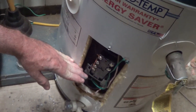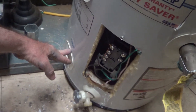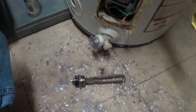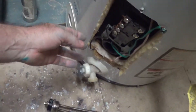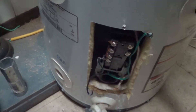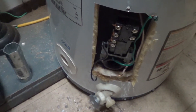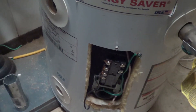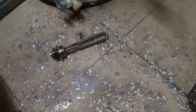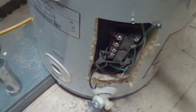I could tell this thing was only about two-thirds drained, so I figured maybe there's a tube going up inside — but the real story is when I undid the element all this crap came out. If you do this, make sure you've got all the power off — you've got a dangerous situation with a lot of water, so you need a proper grounding situation. Don't get knocked on your butt. This hooks through a little cord so I'm completely safe. That's it: a 12-gallon electric hot water heater, in about five or six years, on its third element, with just tons of crap.